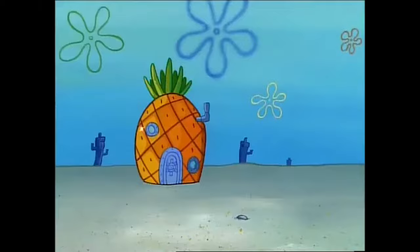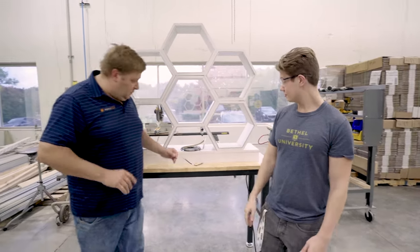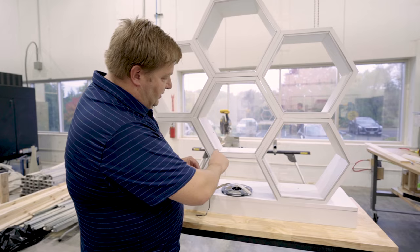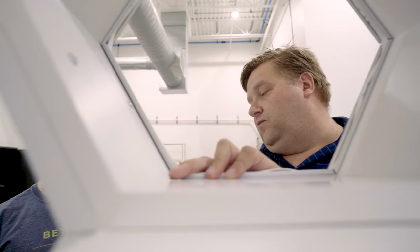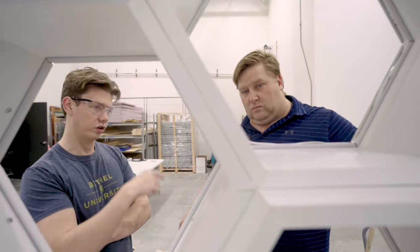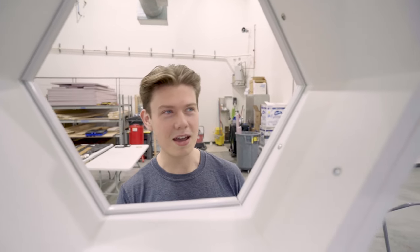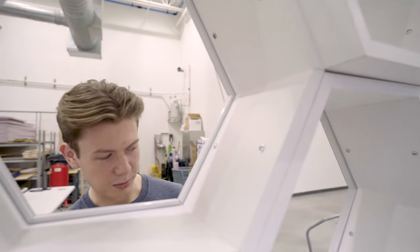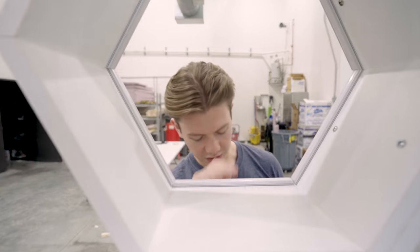So we now have Marty here, a friend of the channel. I brought him in to help us out with the wiring process. We're going to actually use Aspect LED RGB L-Series strip lights, and it's going to go around the perimeter of these openings. We need to make sure we've got where the lead ends on them. Each one needs at least... this reel can only do two. And then the others will have to have leads thrown on. We decided that the tape was not quite sticky enough, so we decided to countersink this to make sure the strip lights go on there flush, as well as put in half-inch screws to make sure these stay on there nice and solid.